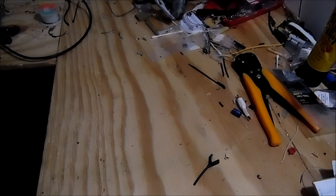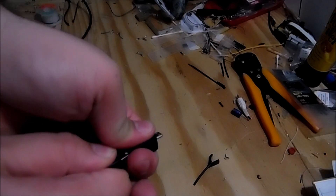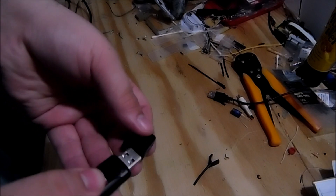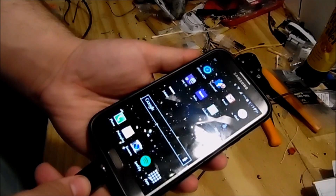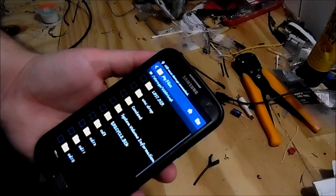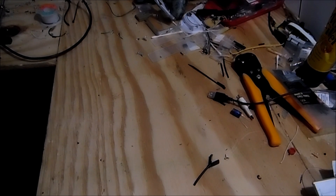It's been about eight hours since I put the liquid nail inside of the USB enclosure. I'm going to pull it out for the first time — it's going to be a little hard but it comes off relatively easily. Let's plug in a flash drive, plug it into my phone, and see if the host capability still works. USB connector connected, and it should pop up a file interface right there. So that means the host cable does indeed work. Thanks for watching this video — if you liked it feel free to comment, subscribe, and share, and I will see you next time.